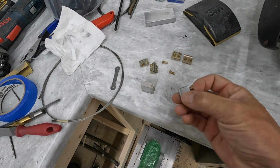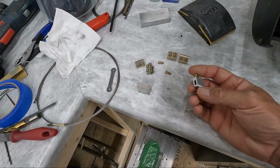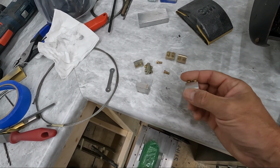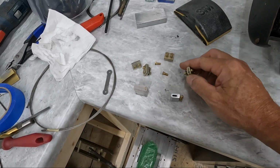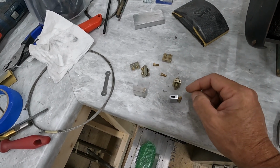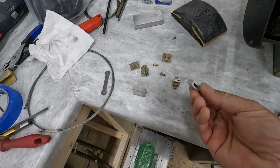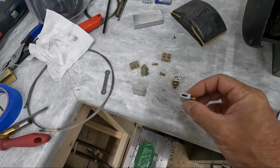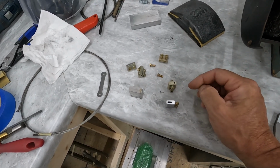I went ahead and made one of the clamps that we're going to use to attach the steering cable to the main rudder cable. It's made very similar to these. It's the same size, 20 millimeters by 15 millimeters tall and 6 millimeters thick. This was, like I said, almost the same to make. It's a little bit different process in that obviously we don't have to cut a slot through it.